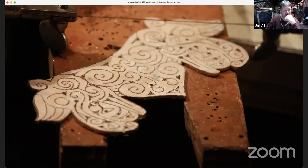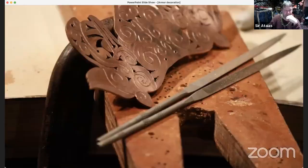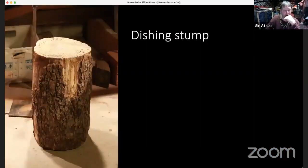And then I started using it, drilled the holes for where I wanted to get to those areas I needed to cut out. And just started working it with the jeweler saw. Then after that was done, got to clean off all those burrs, get rid of the paper, you know, the transparency and the glue, the adhesive of what's left. And just get rid of all those burrs, start cleaning it up, taking the file to the edges so that those saw marks are not so evident anymore. Just doing all the finish work.